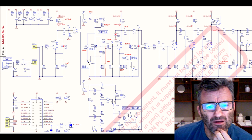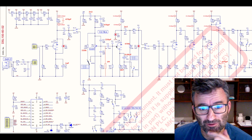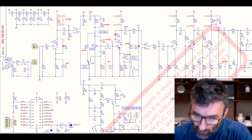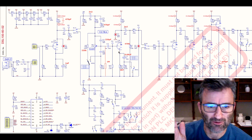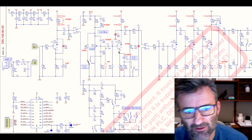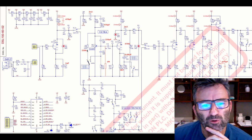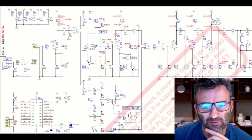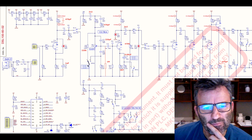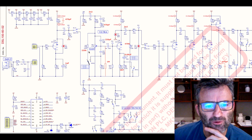I was seeking to reduce the amount of gain coming through these early stages of the preamp and allow a more usable range on it. Because stock, I couldn't get the gain on this past midday without it freaking out, becoming too flubby. So I put a 220K in here and made it permanent. This part of the relay here, because here's the other part over here, is not used. So that 220K is always in the circuit.